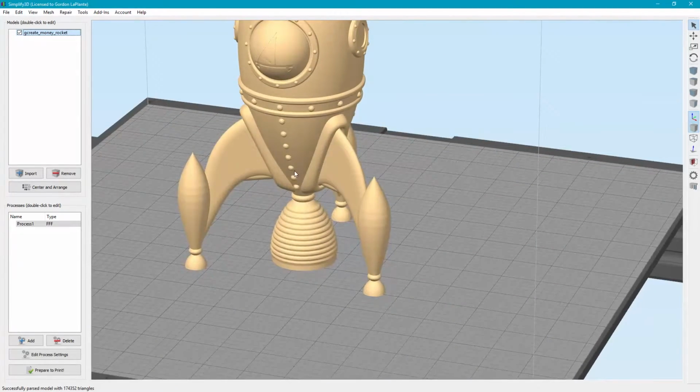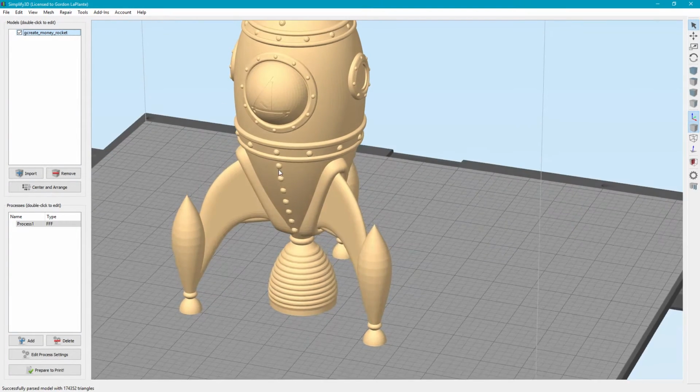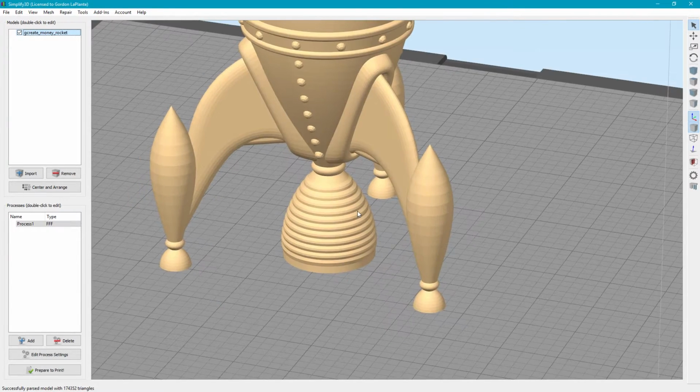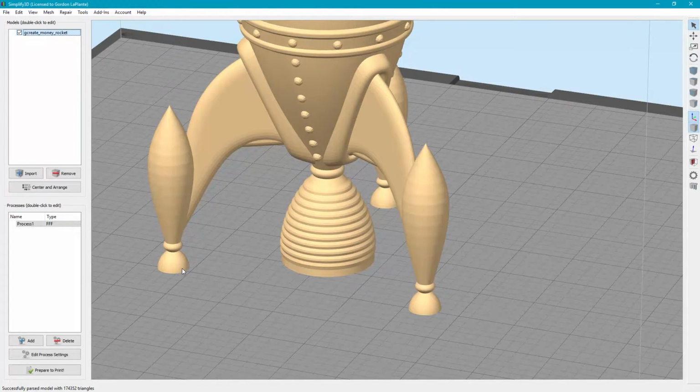So it's a kind of a tricky model, and it's a great model to test your printer on because it has bumps out that might create problems, and it just has a series of great little issues, which is also the other reason we designed it the way we did. In this particular example, because the first layer has such small pads to adhere to the print area, initially we created these triangular connecting points that would connect to 3 nozzles, and then you would cut them away later.